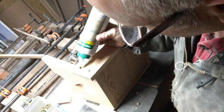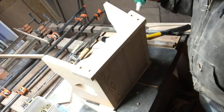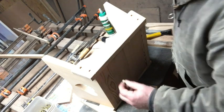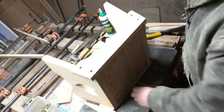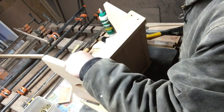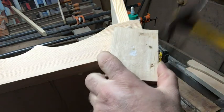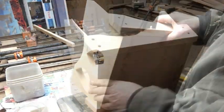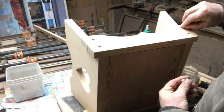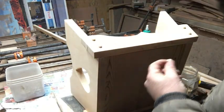Apply the glue to the inside, being careful not to get glue on the outside of the wood. Now I can put in these little 3/8-inch dowel plugs. It helps to put them in the right way making sure they're in square, put them in as far as you can with your fingers, and then just tap them in. Then do the same on the other side. These little dowel plugs are just tapered and they fit right into those 3/8-inch holes.